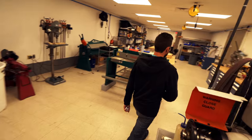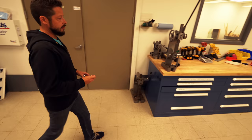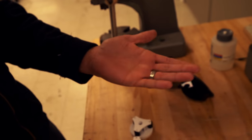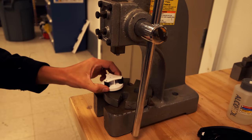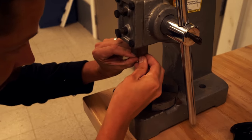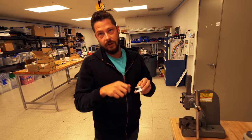The next step — and again we're not fully tooled up at the production stage yet — is we take these precision greased and sealed ball bearings and install them onto a custom arbor on this little arbor press. Just press it in and that's all it takes. The fit — referred to as the press fit — the interference between the plastic and the ball bearing is what we have engineered and are inspecting when we use the gauges.